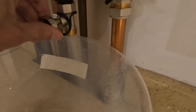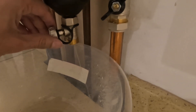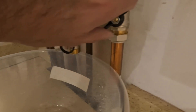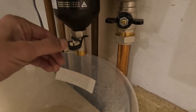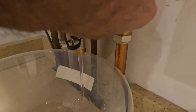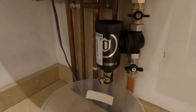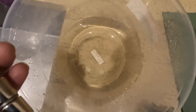It starts seeping out — look at that, it's all coming out now. Anything that was in that filter is flushing out. I've run this heating system for about 45 minutes to an hour, and you can already see metal parts and debris coming out. Look at the colour of the water and you can see those little parts. That's just after 45 minutes to an hour of having the heating on. Leave it running, then put the magnet back in. In the next video I'll show you how much is actually attached to the magnet.